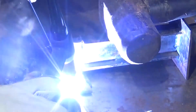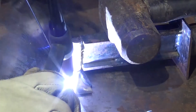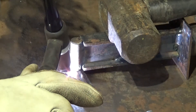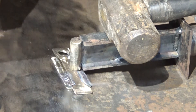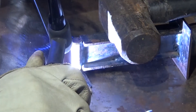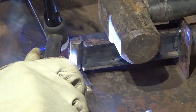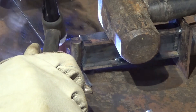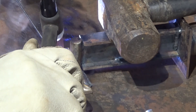I had the first one done, so I'm going to go ahead and do the second side. The edge was beveled down — I didn't do that on purpose, I just had to grind that old ugly weld off and there's kind of a gap. I tried to smash it down with a hammer and I slipped a whole lot, and the weld actually comes out worse than the first one. I'm just trying to practice. One thing I noticed is I'm using 309L wire at 1/16 inch and this stainless is very slightly magnetic — the magnet barely pulls it. The puddle is very watery, and it does pretty much weld just like mild steel, but it's just a little different. I'm having some problem with oxidation because it's not super shiny and there's some white dust all over it, but everything's a learning experience.